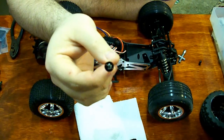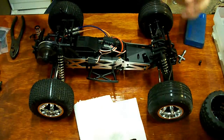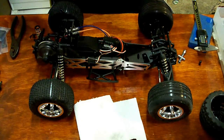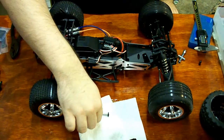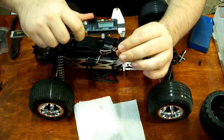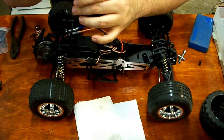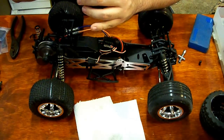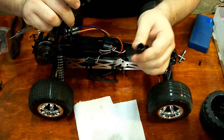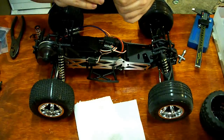These are a 2-hole piston design. .3mm thickness. So we've got a 3mm center rod, dual hole piston, and we have, let's see, the internal diameter on these is 10mm bore. One, 2, 3, 23, looks like 23.5mm depth. So I'll calculate out what that volume equals a little later.